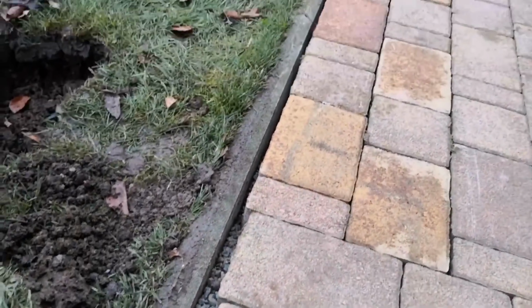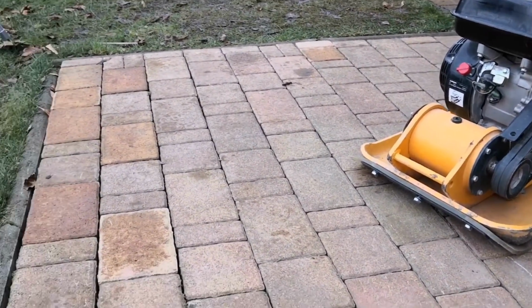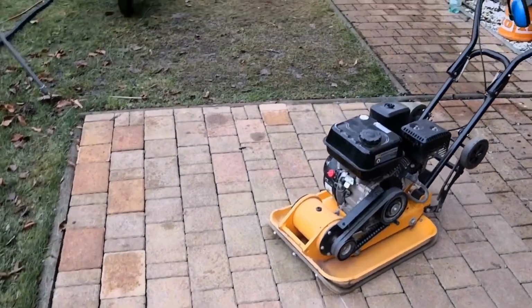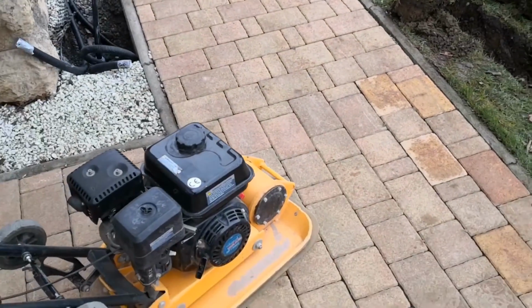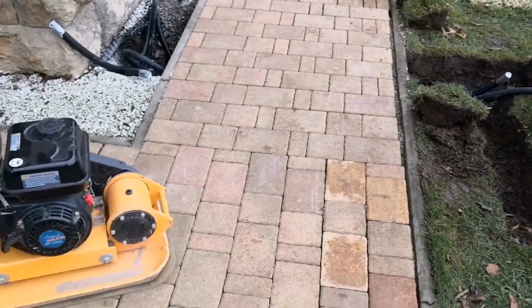I have just very carefully laid the paving stones level and straight. Finally, I will carefully and thoroughly apply the joint gravel, ensuring it is evenly distributed, and sweep it into the joints. It will stay here. The rain will then naturally wash it into the joints by itself. From time to time, I help out with the broom. Then the sidewalk will be just like it was before.